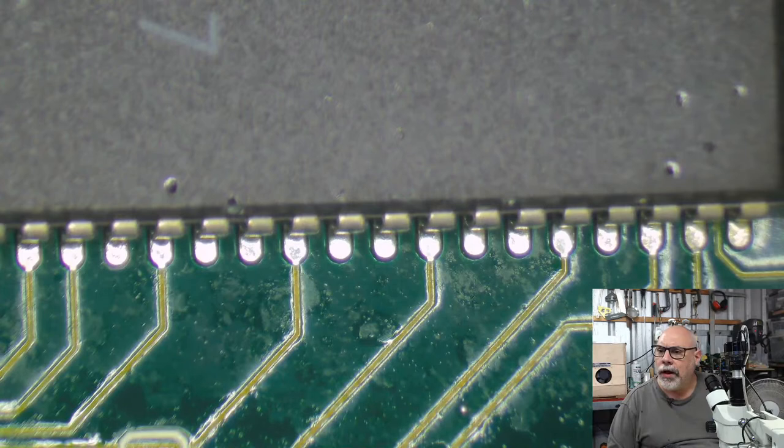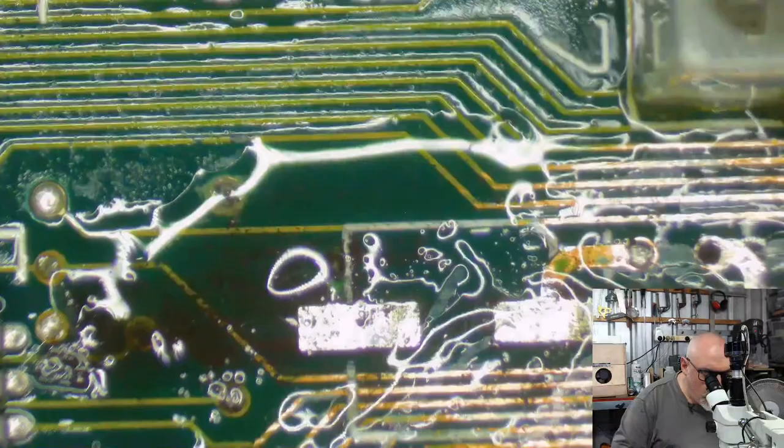What temperature do you have your iron set to? Normally for SMD work, I normally go for around 300. It might be overkill, but it does work well, not that harsh on the PCB. It's a very interesting question there, Ed. I do talk about this a fair bit in my videos, mainly because I am a bit different. You know, everyone knows I'm a bit different, but I work with a really blazingly hot soldering iron, way hotter than I actually would recommend other people use.